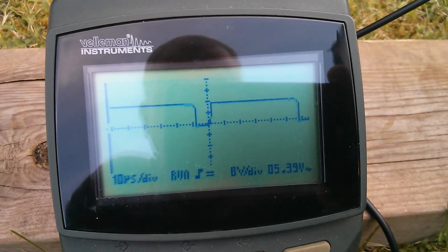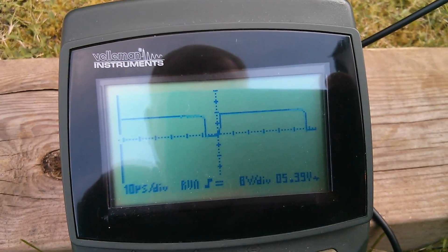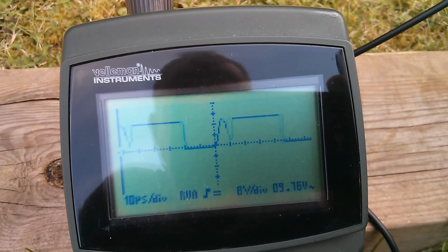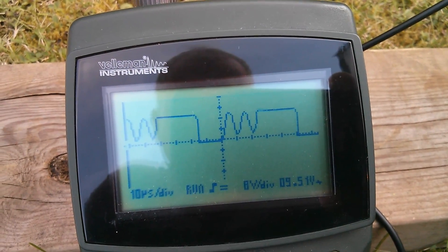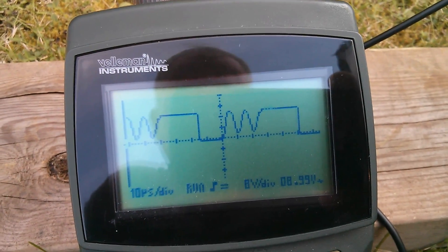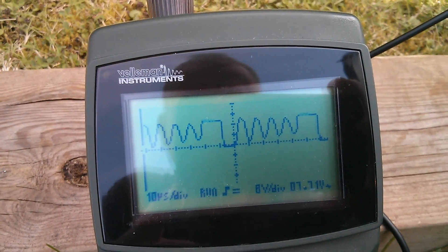You can see that the PWM is at about 80 percent — 80 percent high, about 20 percent low. Now if I start moving that, you can see that at this point it breaks up and we get ringing. But this ringing, unlike the smaller inductor, is pretty much the full swing of voltage. That's a lot of volts of ringing.